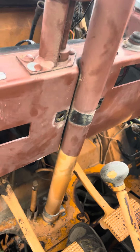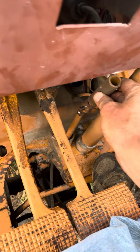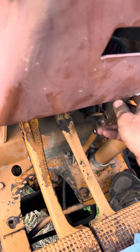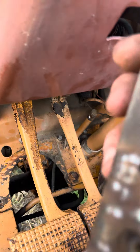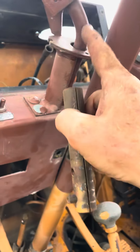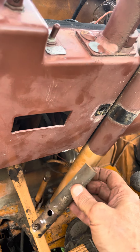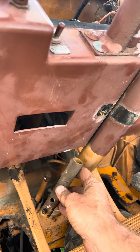But the trick, the secret, is that the forward reverse lever has to be disconnected. So you take those two pins out and this actually goes through — it's sort of kind of deep into this one. So you've got to grab onto it with pliers and spin it off.